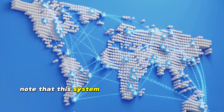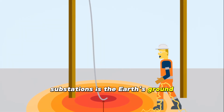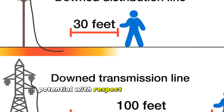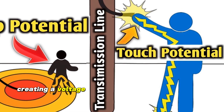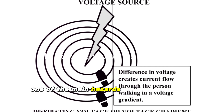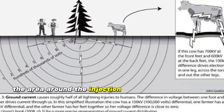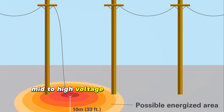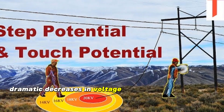However, this system isn't without its challenges. A particular concern in the design of electrical substations is the earth's ground voltage potential rise. The area around the current injection point may rise to a high voltage potential with respect to distant points. This is due to the resistance of the layers of soil in the earth around a transmitter, and the typical mid-to-high voltage ranges used in conjunction with the limited conductivity of the soil create dramatic decreases in voltage with distance.